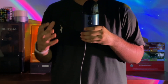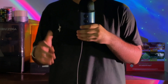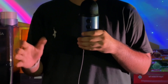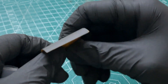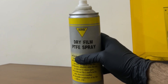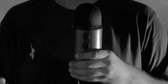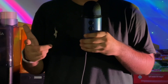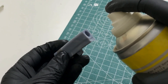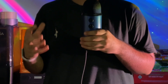I did run into one annoying issue: the occasional sticking of the slider in the barrel. The reason for that is basically how 3D printing works, because layer lines cause extra friction. If I had the patience, or stable hands like my dead grandmother — just to be clear, her hands were just as stable when she was alive — maybe I could have uniformly sanded the barrel's insides and avoided this problem altogether. But for now we're going to use PTFE spray — it's basically lube, but not that kind. It's teflon in a can, the same teflon used in non-stick frying pans. It'll decrease the friction inside the barrel, allowing the slider to move more freely. Since this is a temporary fix, we'll come back to this issue with a more permanent solution in a bit.